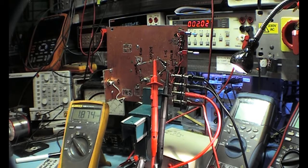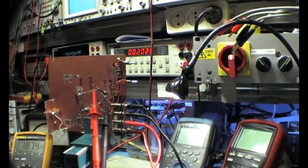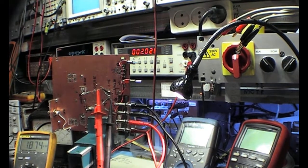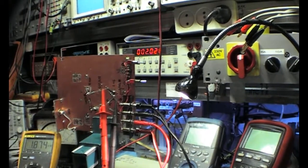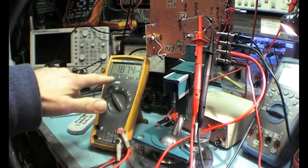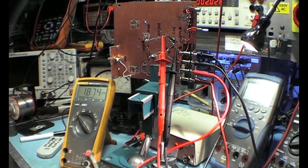And if you draw the substitution schematic of it, then you are putting 10 mega ohms over that 1 mega ohm, so lowering that 1 mega ohm resistance. You can see it also if you look at the current. The current has gone up to over the 1.99 microamps. The extra current you see here is the current used by the meter, running through the 10 mega ohm of the meter itself.